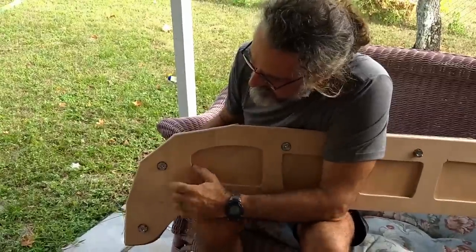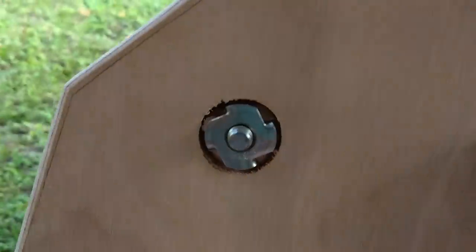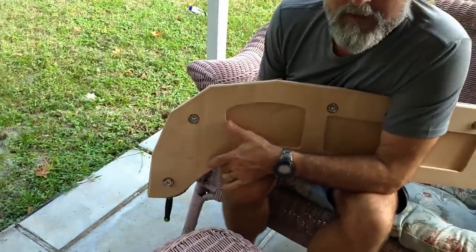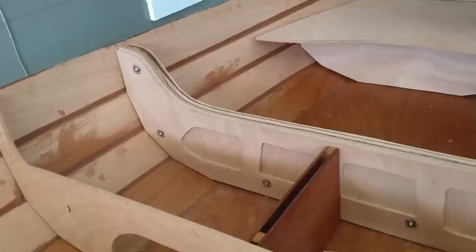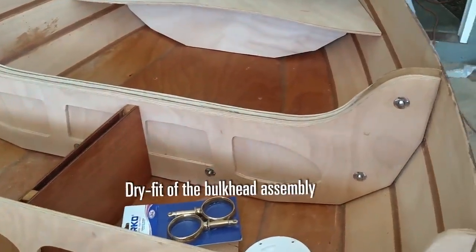Here's the magic. Watch the little teeth go right into the plywood. Rather than using the bulky plastic knobs to connect the two halves, as specified in the CLC plans, Clark suggested that we use T-nuts and machine screws. It means we'll need to use a wrench to assemble and disassemble the boat, but I don't mind. It's going to give us a much cleaner look, and my seascape art will pop.